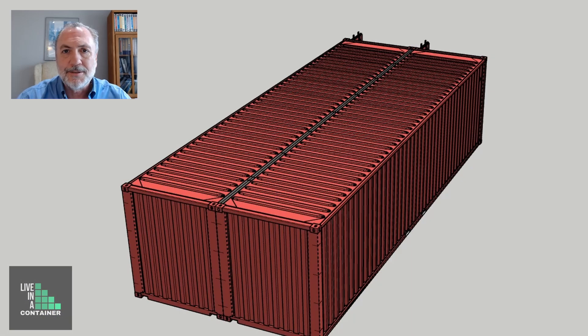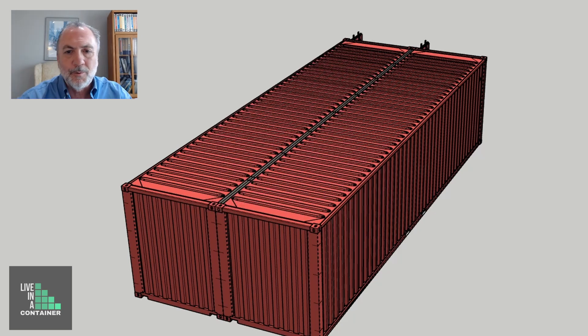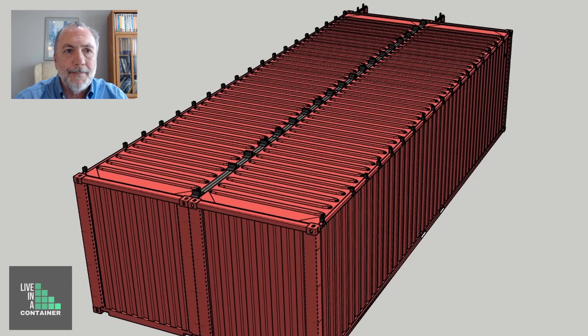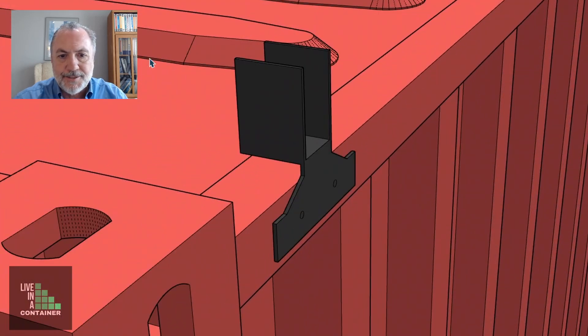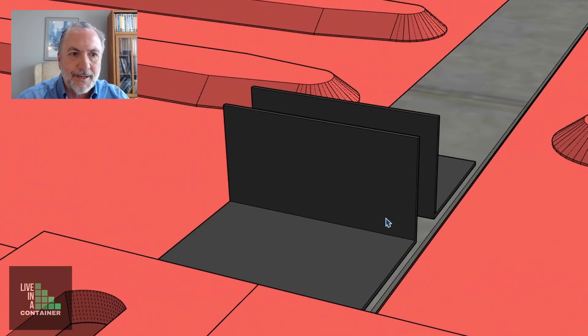A third type is a clip that was designed and is being built by the Shipping Container Guy. I'm going to give you a shout out, Shipping Container Guy. For illustration purposes, I'm going to put this clip on this shipping container design in order to hold our trusses made by 2x6s that are 10 feet long. We'll have some vertical cords that are 2x4s. The clips are going to be along the outside edge, and we're going to have some on the middle part as well.